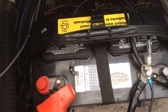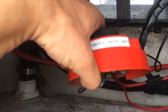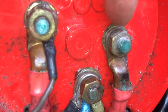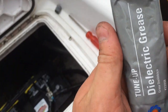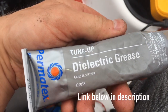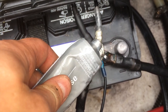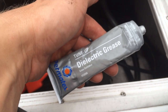Anyway, I just wanted to mention that's how you can set up your dual battery switch. Also, see how this terminal is all corroded — see that dust and that greenness? I just cleaned both of these and put dielectric grease on them. This keeps the salt water corrosion off. Great stuff — goes a long way. Get yourself some and coat all your battery terminals, any bare metal. That's a good tip for you salt water guys and freshwater guys as well.